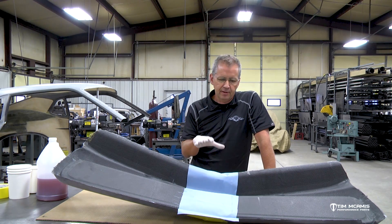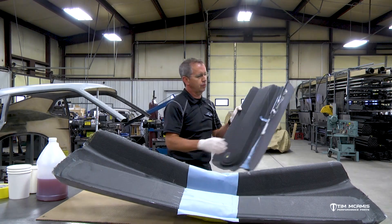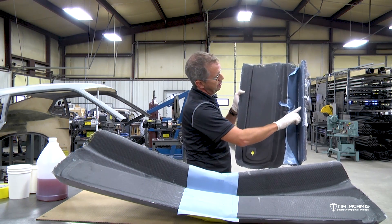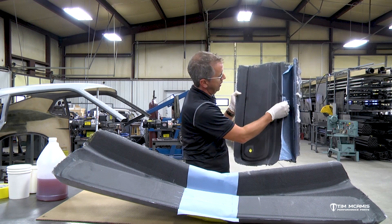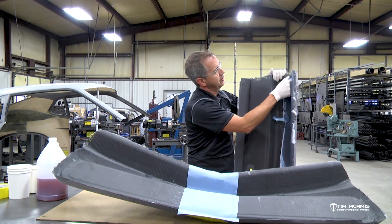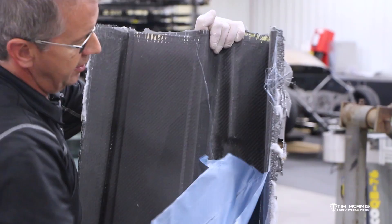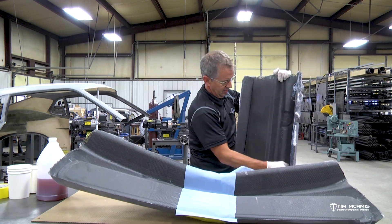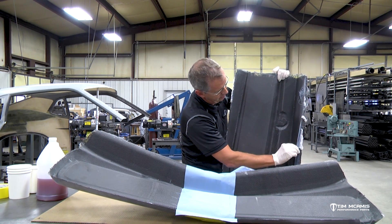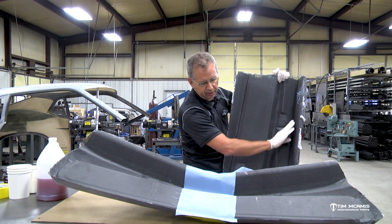Now that we've laid all that material down, I've got a sample part over here that's got peel ply on it to show you what it'll look like when it's done. You can see there are no wrinkles — we vacuum bagged this one, but your repair will look similar: smooth and clean. Then this material just peels off like I said — it's got a little bit of bite to it but it has a release agent, and once you peel it off you're left with a nice finish. Peel the rest of this off and you should have a nice smooth repair with a matte finish.